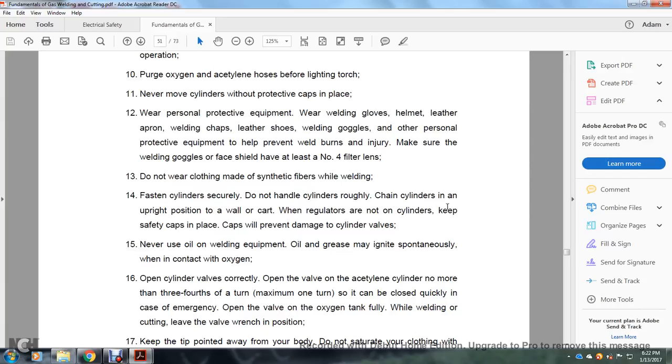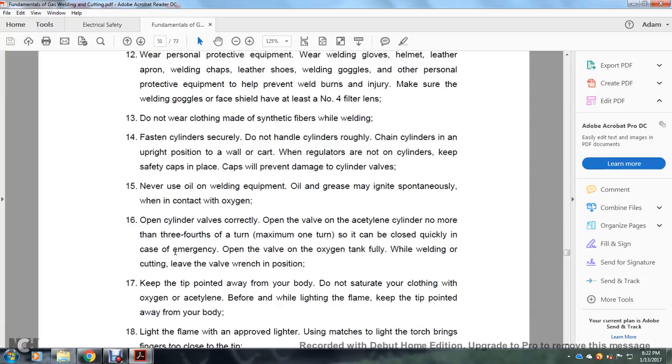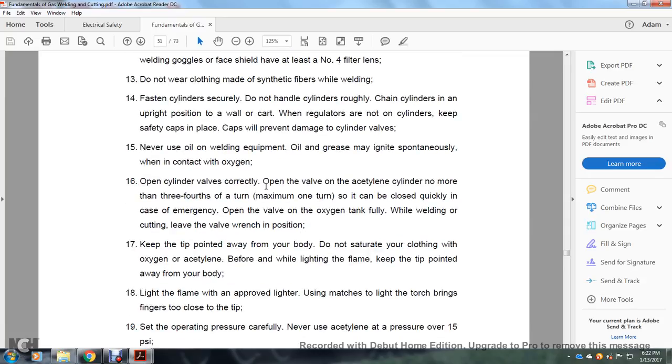When regulators are not on cylinders, keep the safety caps in place. Caps will prevent damage to the cylinder valves. Never use oil on welding equipment. Oil and grease may ignite spontaneously when in contact with oxygen. Open cylinder valves correctly. Open the valve on an acetylene cylinder no more than 3/4 of a turn,